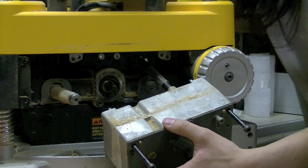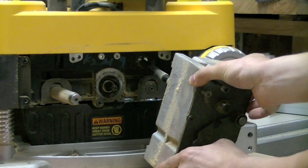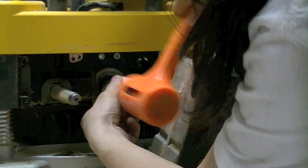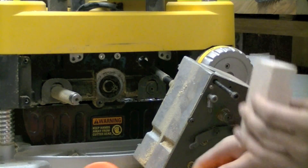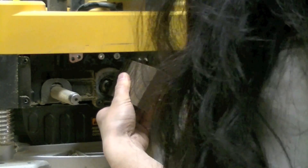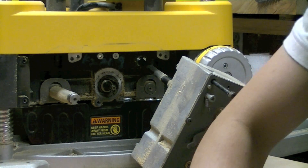There is a little pin in here that is keeping it from going too far — I am just going to rotate it so it is out of my way. There is a helical gear here which you don't want to damage — that is what the hardwood block is for. Tap out the head — easier said than done.